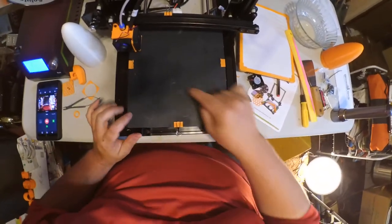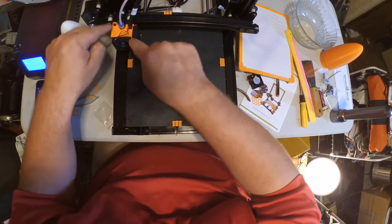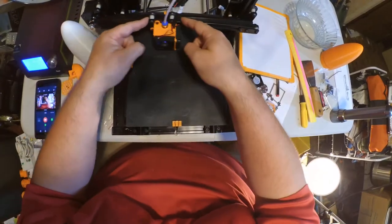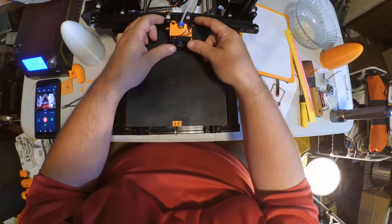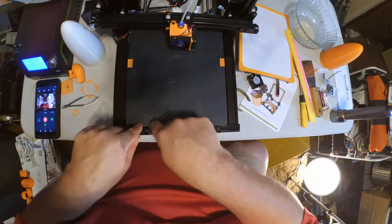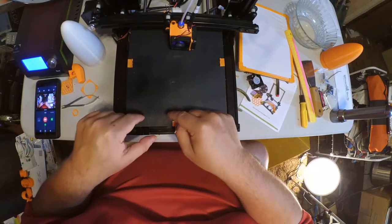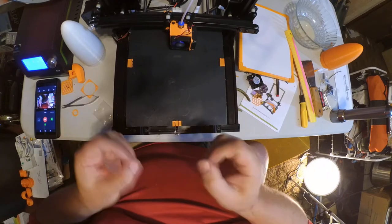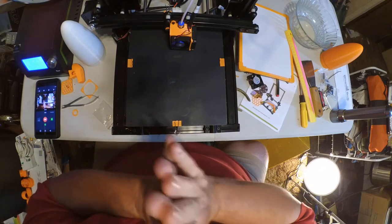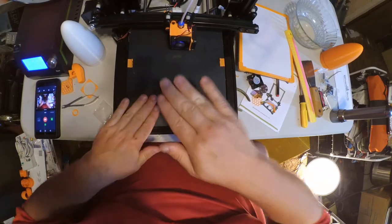So you have to know how close the nozzle can be between these two parts before you're going to have a piece of this printer, whether it be this carriage fan, whether it be the X gantry, whether it be the pulley wheel, you have to know what your minimum safe distance is and space your parts accordingly so that this hardware doesn't crash into the part that's already there because the printer can't see it. The printer has no way of going, uh-oh, I'm about to crash into that, I better not do it. It can't do it. You have to do that. So I hope that explains better sequential printing. It's a manual process. You have to do the brain work to figure out where to place things and how high you can go.